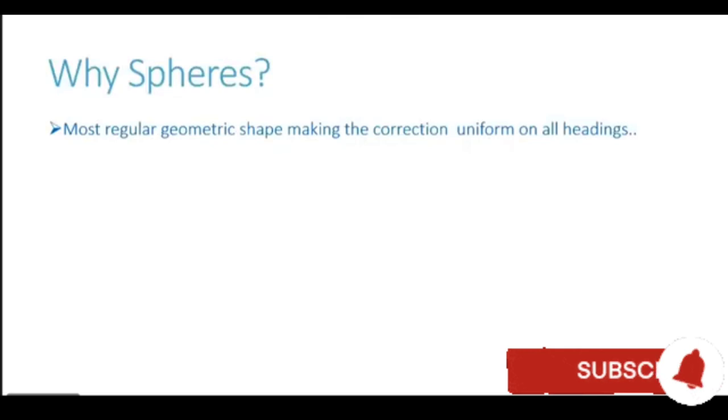Now coming to the question, why do we use a spherical shape for the soft iron corrector. The reason for using spherical shape is that a sphere is the most regular geometrical shape. You look at a sphere from any aspect or from any angle, from any direction, it presents the same face or the same aspect. So irrespective of the vessel heading in any direction, the vessel rolling or pitching, in any case whatsoever, the sphere presents a uniform correction in all the conditions. So that is why the shape of the corrector which is chosen is spherical.